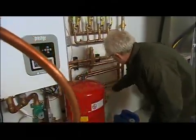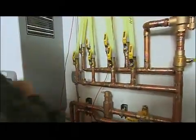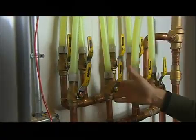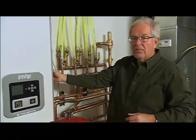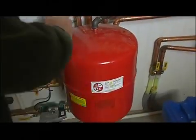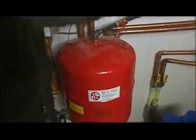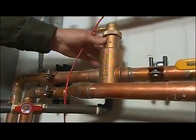This is a supply tube that comes up. These four tubes here and two tubes down there pump polyglycol up into the tubes throughout the house, and then all that gets returned back down through these tubes, circulates back into the boiler to heat back up again, repeating that whole process. The expansion tank accommodates the expansion of the polyglycol when it heats up. The air eliminator is designed to purge any bubbles in the system to keep corrosion down and make the whole system work a lot better.